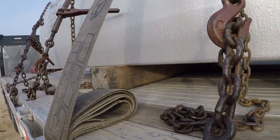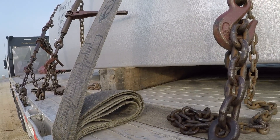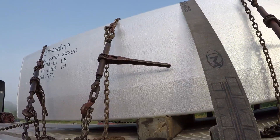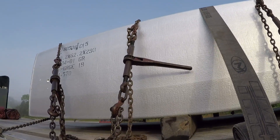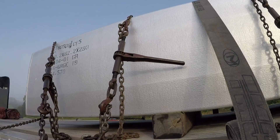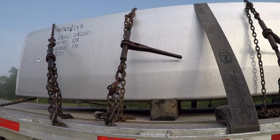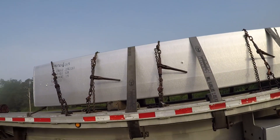See how that board is getting squished? It's pine — soft wood — so it's going to mash and squish. First things first when dealing with ratcheting binders: just use regular motor oil and a little brush or cleaning cloth, dampen the end good with oil, open your binders all the way out, and get those threads oiled up. WD-40 and stuff like that is totally useless — rain will wash it right off.